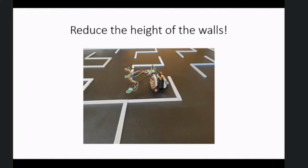3 millimeter walls can be lasered from 3 millimeter white acrylic with good accuracy. You get lots from a single A4 sheet, costing about £4. That's how these were made. So that saves a lot of the cost of the thing, but there's still a problem to get over, which is putting everything in place.